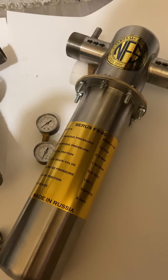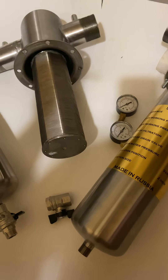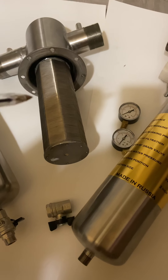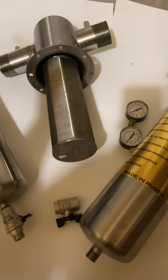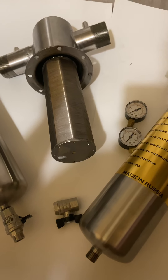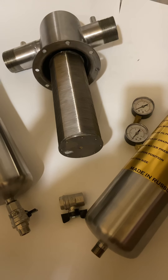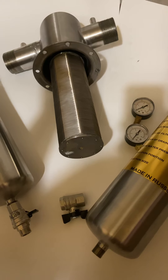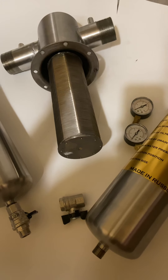Even dissolved metals and any kind of sediment will not pass through this cartridge. Salinity problems, salts in the water, calcium, iron — it will help with all of these issues so that pivot systems on the farms don't get clogged.